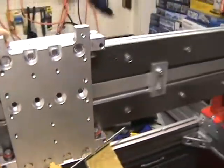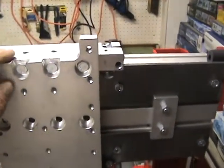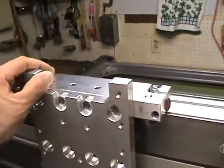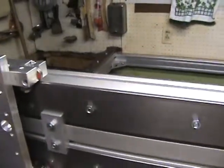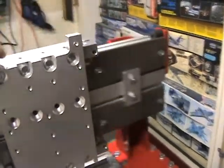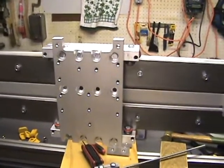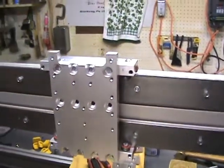Right now it runs pretty true. I don't have any looseness in any position along the rails. If you put this together and it goes flying off, that means you don't have enough tension and you're gonna have looseness in the system. Right now it's pretty tight but still moves freely — it doesn't take much effort — and it's got pretty good tension, so I think I've got it in the right position.